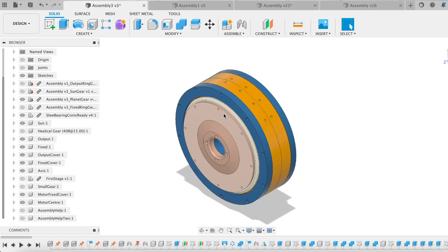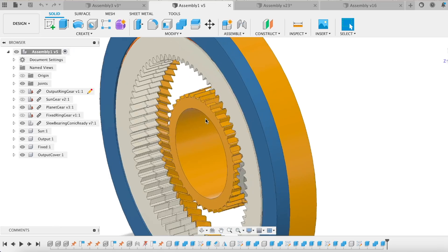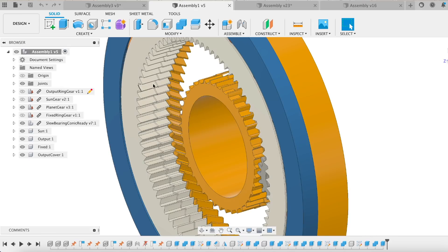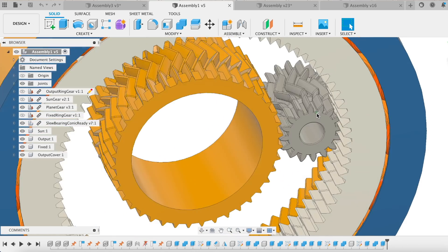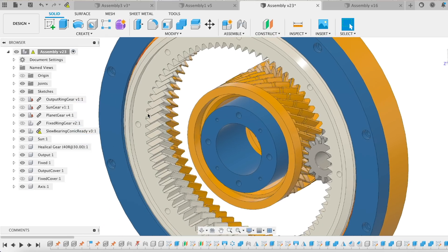This design should have eight planets; I put only one here. Before I came up with this design I tried different other designs — basically different only in the helical gears. Initially I wanted to put the helical gear only on the output ring and a normal gear on the fixed ring, in order to avoid axial forces on the fixed gear. Because if you have the helical gear, depending on the direction of rotation the planet is going to push or pull the fixed ring. With normal gears there are no axial forces.